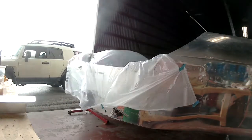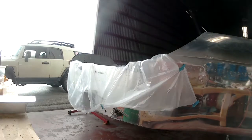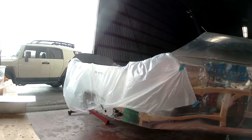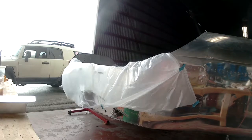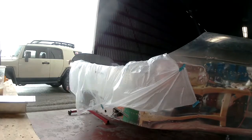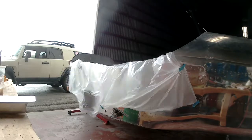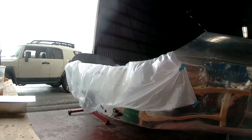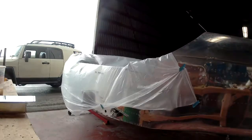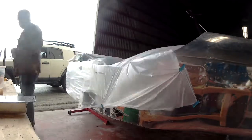What we're working on is more of the back panel. The Garmin system I'm using, which is really awesome, consists of a display and then two or three instruments for all of your heading data and reference data, and then there's a whole bunch of boxes that take the rest of your plane's normal electrical inputs and use that to display and manage all of that data inside of the Garmin system.